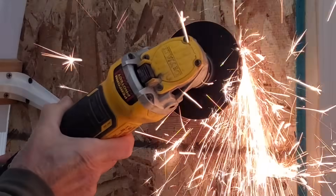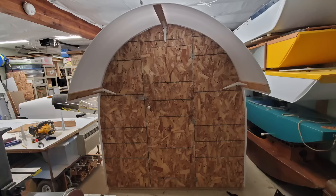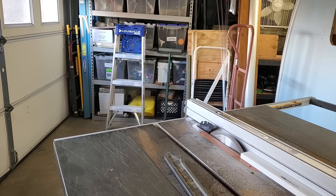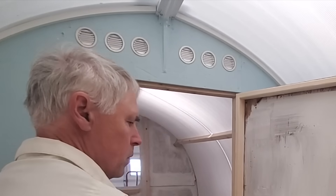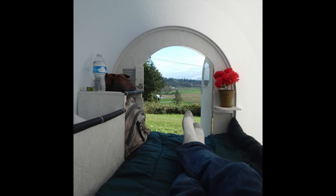I didn't always have the right length of screws, so here I'm trimming the tips of things that are hanging outside. Like the Conestoga homeless shelter with their large overhang, I compromised and just settled for a little one, but I think overhangs are important. I used an elastomeric paint to do a good priming coat on the OSB. I also used the technique of splitting a one-by-two eight-foot PVC trim board down the center to support the front and back wall to the roof — you can see a few examples of that, and it works out pretty good.